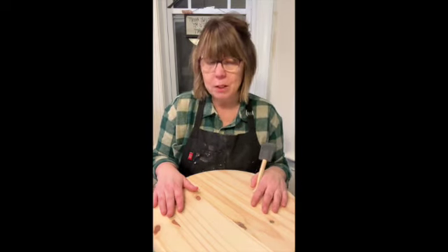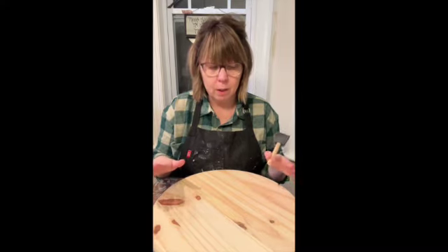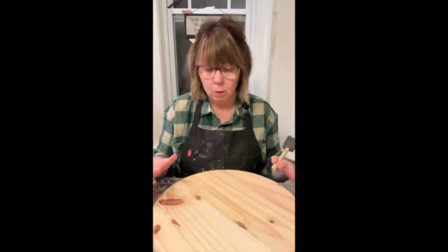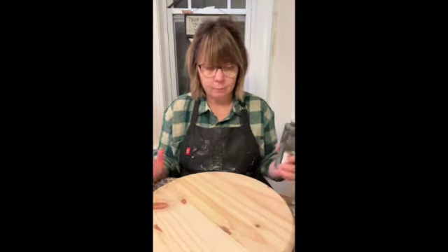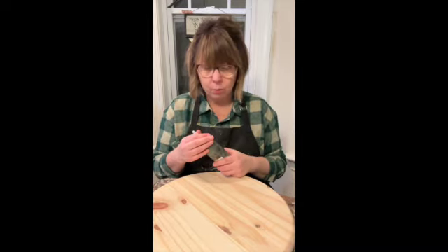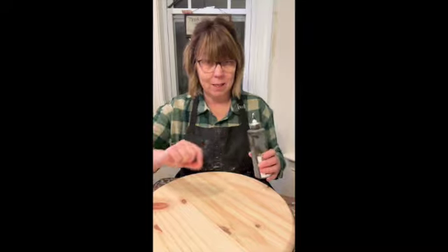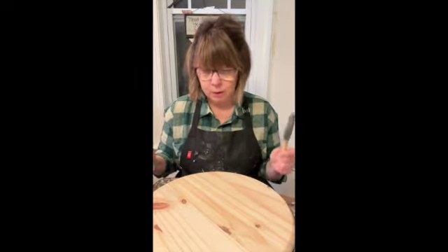For this, I'm going to wait 24 hours between when I put this on and when I do my stencil. We didn't really do that in the shop before — we would use hair dryers and kind of dry it down really fast — but that's really the way you want to do it. You'd like to let it sit for a while. Your bottle will have a little squeeze to it so you can do it the way I'm doing, or you could dump your stain into a plate and dip in that. Whatever you're comfortable with.